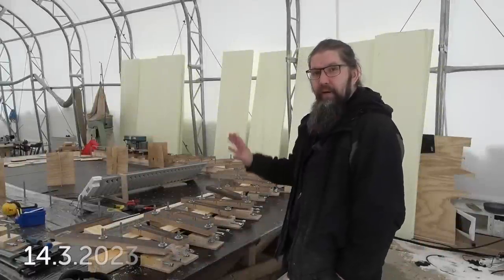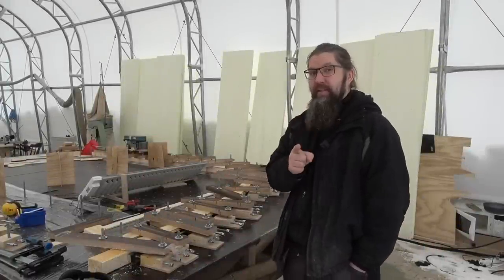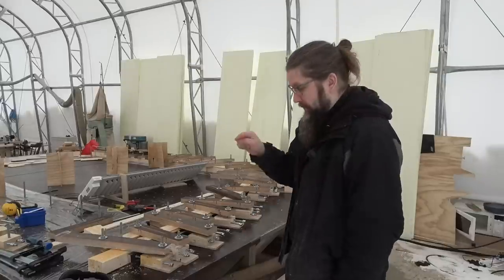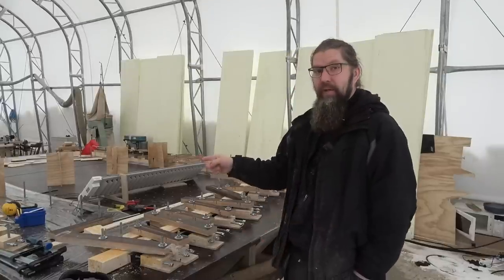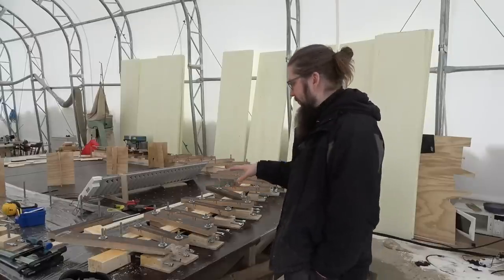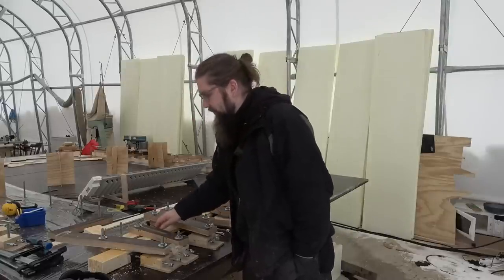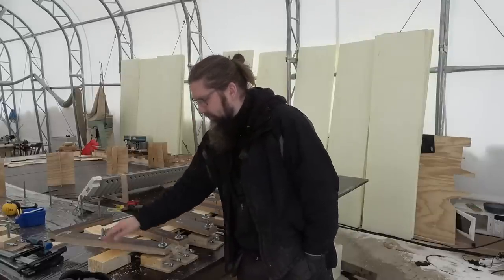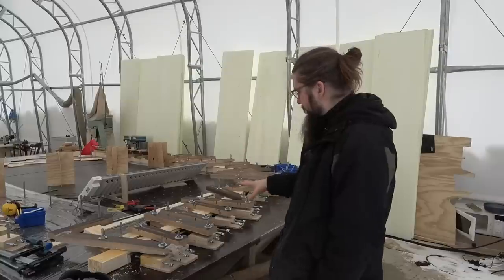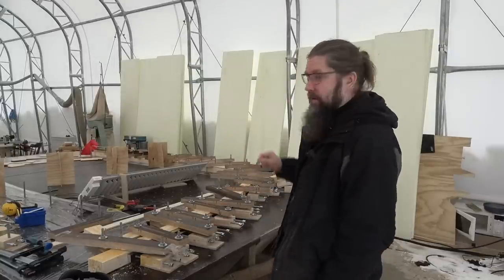2 days later, frame number 7, part 1 is done and solid. Luckily, I visited here yesterday and I found out that the wire for the heater was actually unplugged, so there was 24 hours without any heat inside the box. Now the epoxy feels just a little bit sticky, but I think it's solid enough for me to get these clamps off today and laminate the other side.